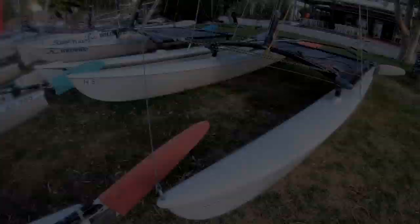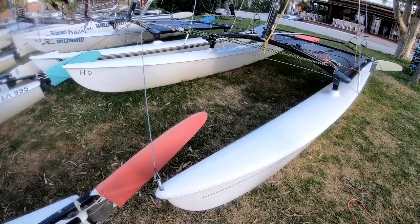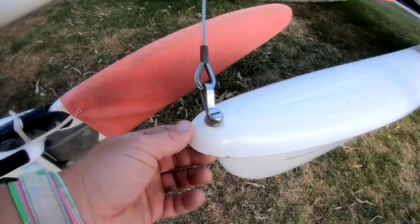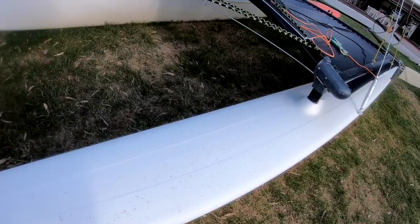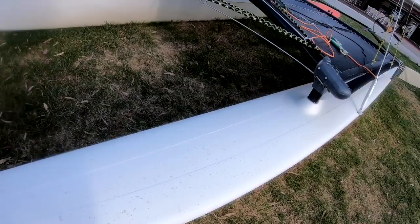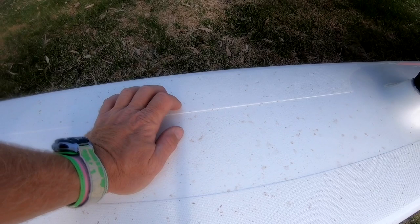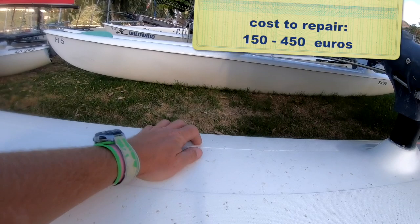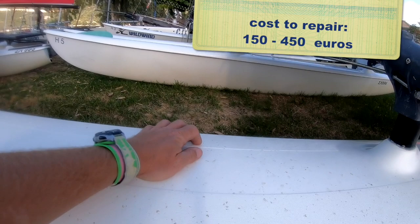Perhaps taking people for rides, or going fishing — something like that. So firstly we're going to take a look at the hulls. Going from front to back, starting at the bow tang area, we're looking for any cracking around here. A few small cracks are okay — that's generally cosmetic. A significant thing to check for on the deck and sides of the hulls is if it's soft at all, so give it a push with your hand. If that goes in at all, that can mean there are problems deep inside, which can lead to significant expense to repair.